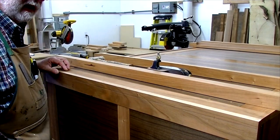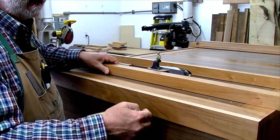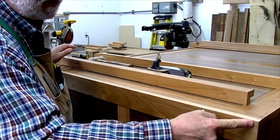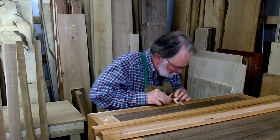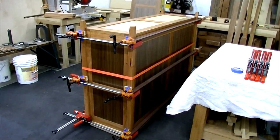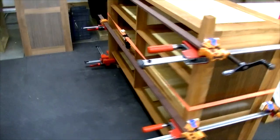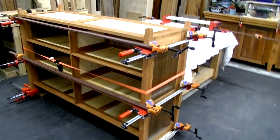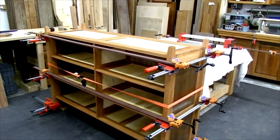Since I finished the side in advance, I need to rough up the shellac along where the leg will contact it. I made a line marking the extent of the leg's travel and I'm just going to rough this part up so that when I glue it I'll get a nice joint. Then here's the dry clamp-up for the legs. The first thing I do is put on a strap to hold the legs in position so I can get clamps on. Then I put on the short red clamps, which also give me something to rest the big long clamps on.